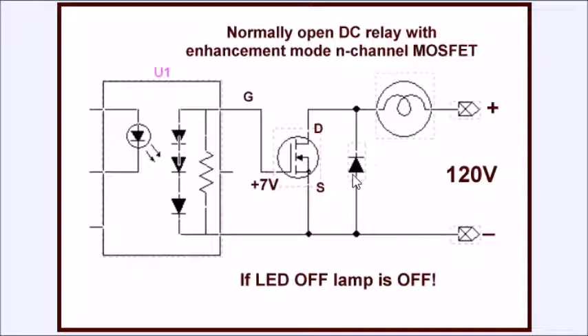This diode shown is the internal diode of the IRF630 MOSFET. If you use a MOSFET without an internal diode and you're using something other than a resistive load, you'll need an external diode. This is very important. The key advantage is that the gate turn-on voltage is not derived from the high voltage, and that eliminates a lot of headaches. When you energize the LED that produces the voltage, you turn on the power MOSFET. Looking at this from the relay viewpoint, this would be normally open — apply power, the path closes, and the light bulb lights up.